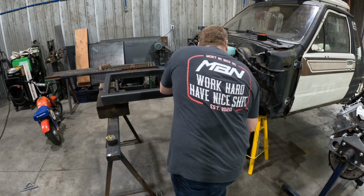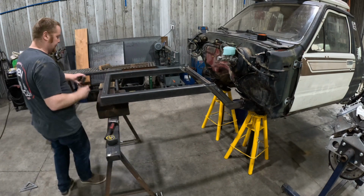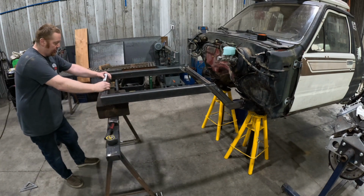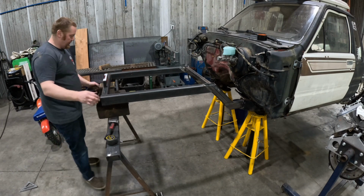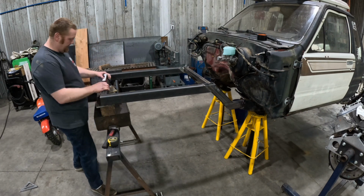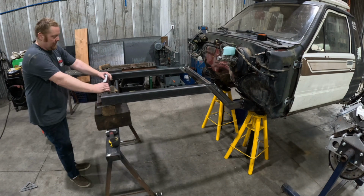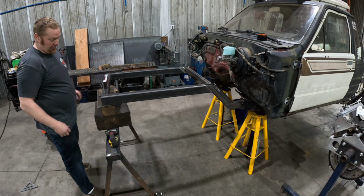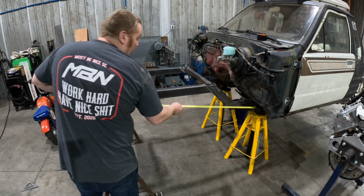So we hit that like that. Probably way too much, because now we're 0.3 the other direction. You just kind of got to play with it. Okay, we're flat. We're within 0.05, which is better than from the factory.